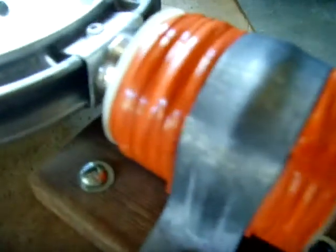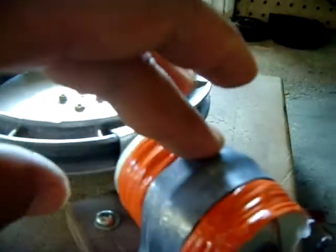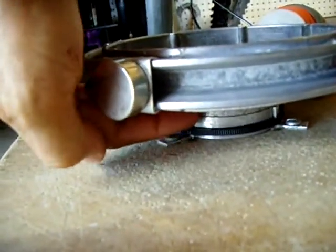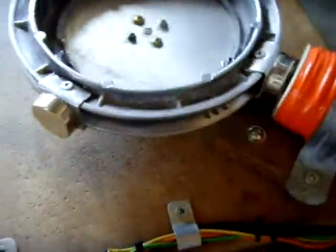For the coil, I use 20 gauge and 26 gauge wire. You can see the core — it's a bunch of steel rods. I just wound it full; you wind the 20 and the 26 at the same time and just fill the whole spool up. You can see the back of the core — it's the regular Bedini circuit, the SSG. There's the potentiometer, the transistor, and right here is the neon lamp. This bearing I found at the base — it was an old VCR head and the bearing on it is so smooth, so that's what you want to use. These magnets are super powerful.